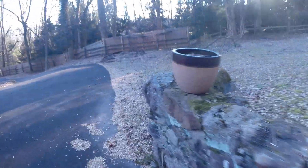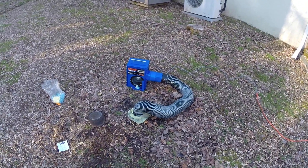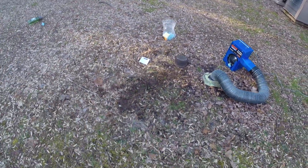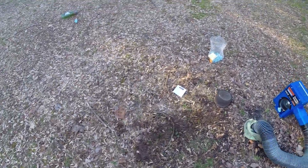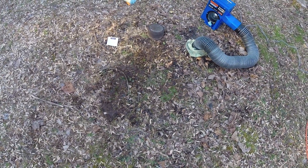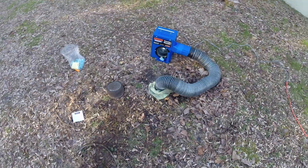Coming back outside now. The candle is just about done. I'm also seeing some smoke coming through the ground here, which is telling me we might have some issues with our septic system. Clearly the pipe running to the septic tank is fractured, as the smoke is coming right up through the ground. So we've got some bigger problems here than just that scent in the basement — and only a smoke test could have told us that in five minutes.